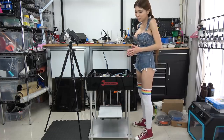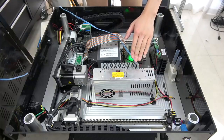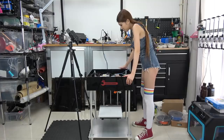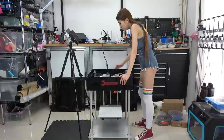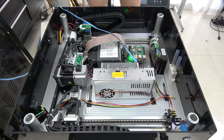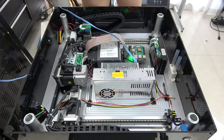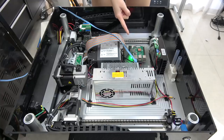After all, this is just a prototype and they are going to make some changes later. Here they are obviously using a power supply. And this one — at first I thought it was a stepper motor, because usually for a normal 3D printer it is a stepper motor, but this one turns out to be a servo. In the front there is the motor and at the back there is the sensor, so with the servo it always knows its position. I'm excited to see how it performs. On the side we have ball screws instead of belts for the X and Y axis — this is pretty unusual, but let's see how it works. All the parts seem heavy, industrial, and good quality. I am already connected to OctoPrint, so now I am going to try to level the bed.